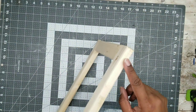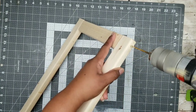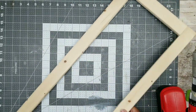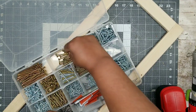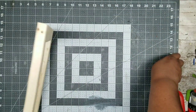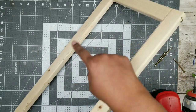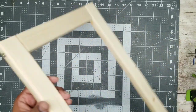Once that's done, we're going to use screws. Start by drilling a pilot hole in the side of your rack — definitely don't skip this step. Drilling a pilot hole will ensure that your wood does not split when adding screws. Repeat this for all four corners. Once all pilot holes are drilled, use some two-and-a-half-inch number eight wood screws to secure them in place. Start by hand-threading the screw in a couple of times, then use your drill to screw it all the way in. Repeat for all four corners. Now all corners have their screws in place and you have a nice, solid, sturdy frame.